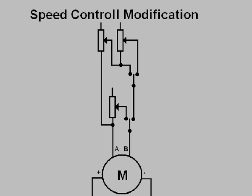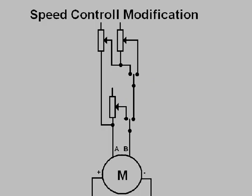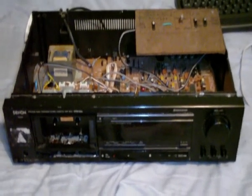It doesn't work this way with all motors, but with the motor I've put in it does. For variable speed, the switch at the bottom is in this position, and the shaft of this potentiometer is accessible so it can be used to manually adjust the tape speed — which is good for voice effects and if you want to record at a slow tape speed to save space. All the potentiometers are 20 kilohms — with other motors they may need to be less or more, but 20k seems to suit this motor. That concludes the explanation of the diagram.